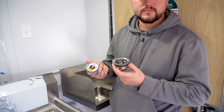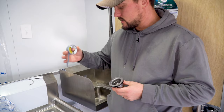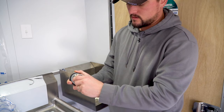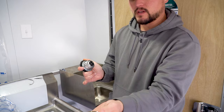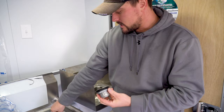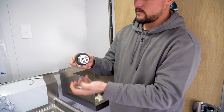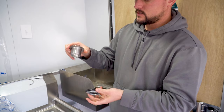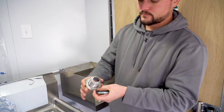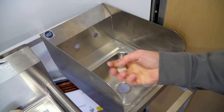This tape is rated for gas or water lines - it's called mega tape. I like to use it so I don't have to switch between white tape and yellow tape. For the drain, this part goes underneath and this is the fitting that will go inside the slip pipe. This is the drain stop strainer. You'll unscrew this to tighten up the drain to the sink, and this is an o-ring seal that goes underneath the sink with the nut.